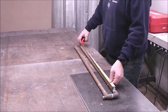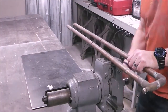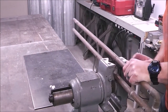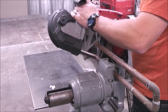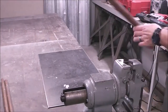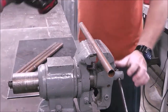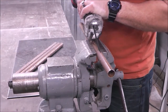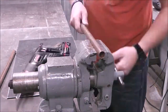What I'm using here is some three-quarter inch copper pipe that was left over from a previous project. I cut it up into equal lengths and get it ready for the next process. You can see all the cutting, and what I do here is I'm going to split all four of them lengthwise the whole length.